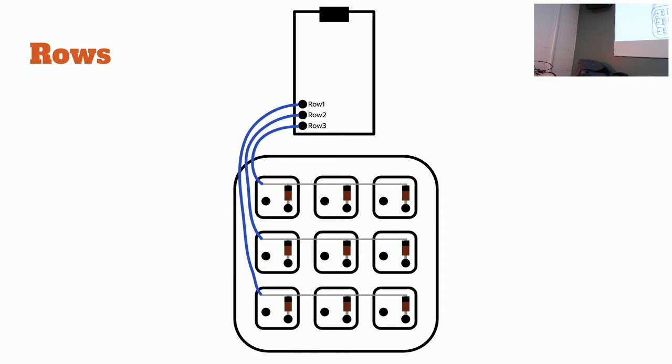You need to clean the tip. So that will help. Nope. Don't touch the solder to the iron. Try and heat just the area with the wire, and then push the solder into that.